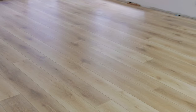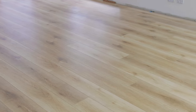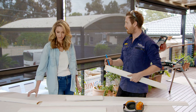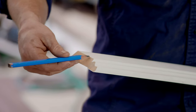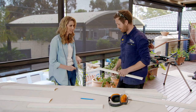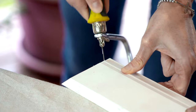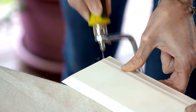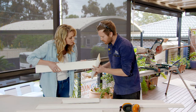It takes a lot of skill to get a skirting board right the first time, so Sean's going to give me a hand. Generally what we do is we back cut the timber with either a miter saw or miter box, and then we just trace out all the timber the whole way around there with a coping saw. So basically we're just tracing along the profile, the edge of the timber, just cutting it all out. It's really good because it doesn't matter if the corner's not square — it should just slot in nice and neat just like that.